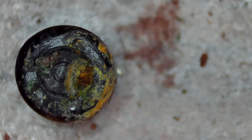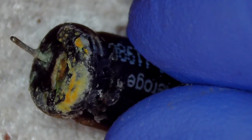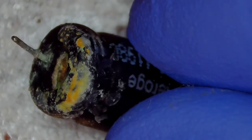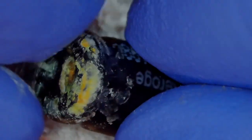Here's what the clock capacitor looks like — let's get this into focus and you can see it doesn't look too healthy. The leg also came out inside the motherboard, which is alright — it's not going to hurt anything to have that leg just standing there. But you can see this clock capacitor has already leaked quite a bit, so it's a good thing we pulled this one out.